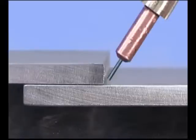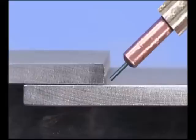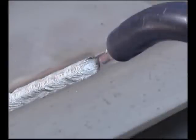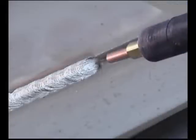As the metal thickness increases, direct the wire into the bottom of the joint with the wire feed gun angle to help push the puddle up. The drag angle affects the shape of the weld bead. Holding the gun more perpendicular to the weld allows a faster travel speed and produces a flatter bead. With the gun angle slightly back towards the weld, a slower travel speed can be used to build up more weld. Avoid angling the gun too much.